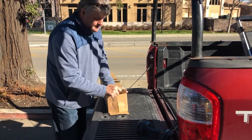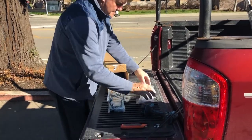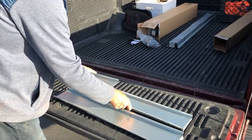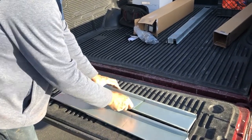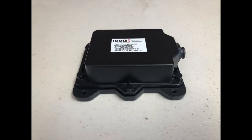Next, the following is what's contained in your Ice-Q kit. The kit includes one channel sized appropriately to fit your particular freezer model and two pairs of flat sheet metal cold wall brackets that slide together. The parts bag included in the cold wall kit contains: power supply, zip tie, one inch hole grommets, cable ties, Y adapter, coax sealant, half inch sheet metal hex screws, and one controller.